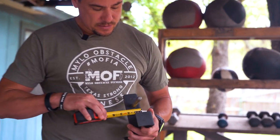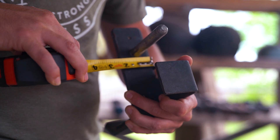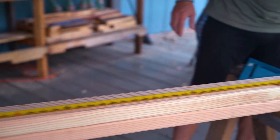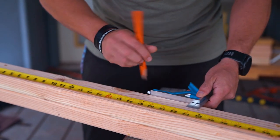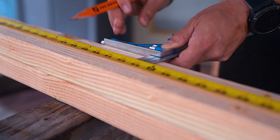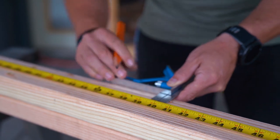The next step is to drill the holes for the J-cup inserts. This J-cup is one inch from the edge — that's the center of that peg. You want to measure your J-cups because some are made differently; measure from the outside to the middle of that peg. I'm going to put a tape measure all the way down the side. I have a square marked at one inch so I can square it up and mark exactly one inch in. My first hole mark is going to be at 37 inches, then I go up three inches for each subsequent hole.